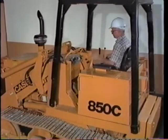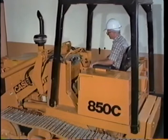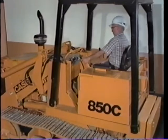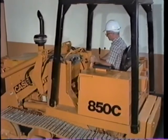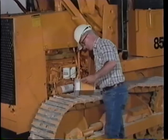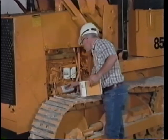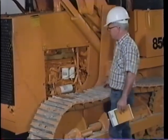The parking brake and the manual foot brake must each hold the crawler in third gear and at full throttle. If not, follow the brake adjustment procedure in the operator's manual. Good brakes are critical to the safe operation of any machine. Don't attempt a repair you don't understand — ask questions or get help if you're stumped. That's much better than trying something you aren't trained for; otherwise you might cause a machine malfunction which could cause an accident.